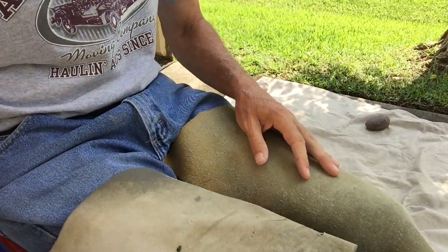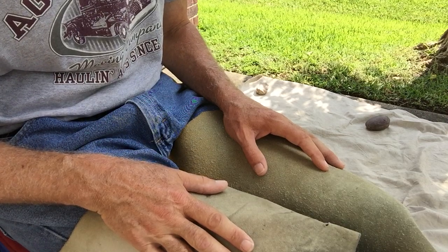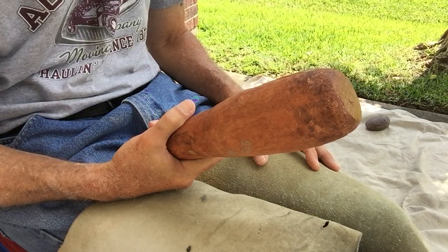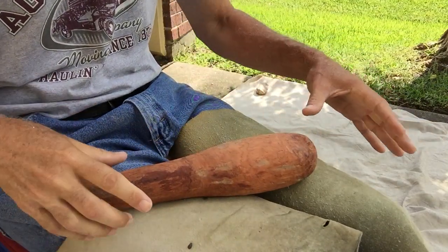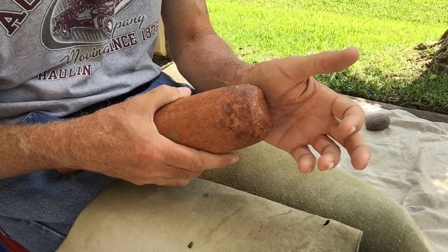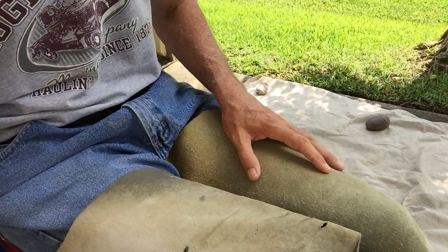All rocks are not the same. If you're hitting the heavy rocks, the hard stones, the granular crap, the well-cemented crap like a lot of the guys in the Northeast are hitting, you need slow and big power. Sometimes they'll be hitting it with something like this, or bigger - step up to something that has quite a bit of elasticity or compressive nature to it, where it stores the energy, but then it has enough mass that it still puts it into the workpiece in such a high amount that the workpiece initiates the crack.